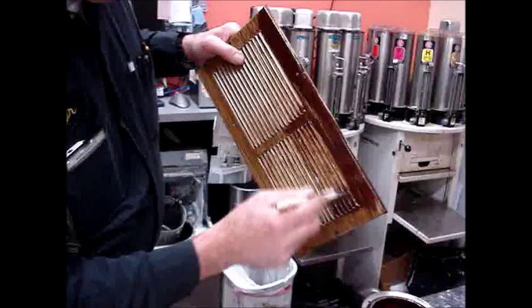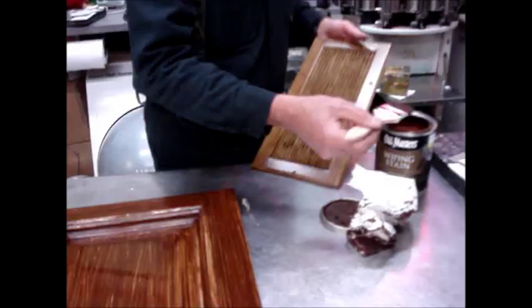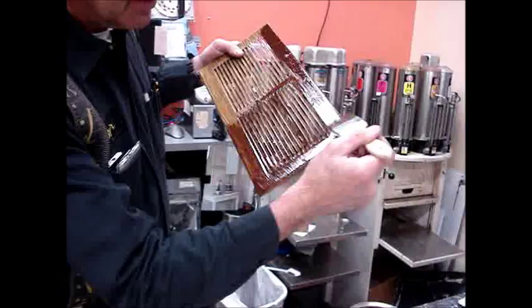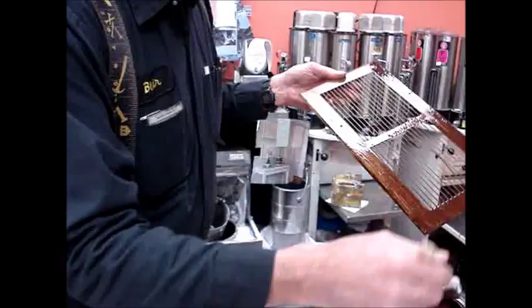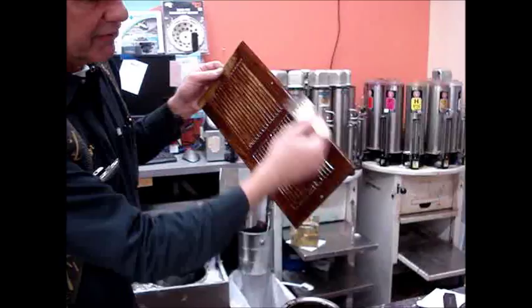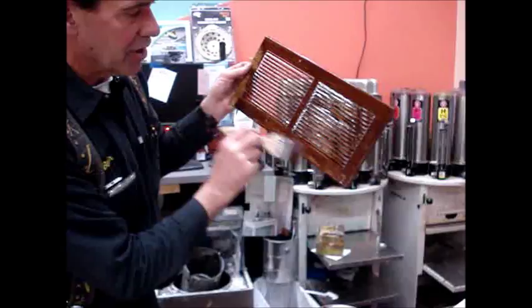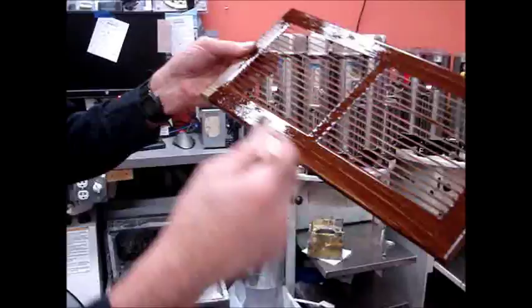The other cute thing is when you take a kitchen and darken it up, a lot of times you're already dealing with a piece of wood. So it's pretty easy to make the piece of wood look darker because you already have a base coat of brown. Kind of like what I'm dealing with here — I have a base coat of stain on this project, and that's making the second coat go on just a little easier. What I'm doing here is just letting the tips of the brush very lightly on the surface, not pushing on the brush at all — just letting it float over the material, drag the material, pull the stain. So the second coat, as you can see, is filled in.